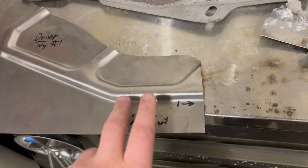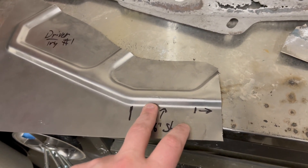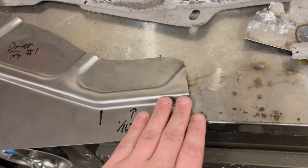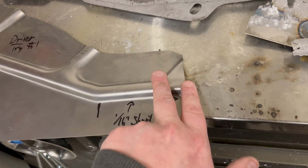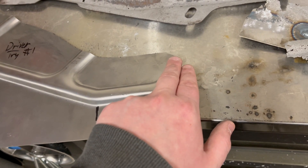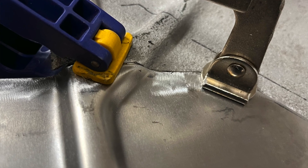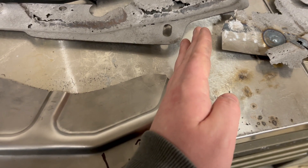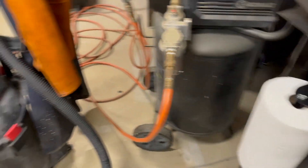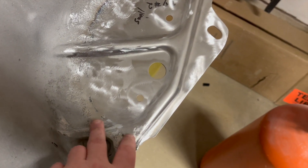The 3D scan software will get me to probably within a millimeter or two of where everything should be — it's not a thousand percent precise, it's literally my iPhone, not some $10,000 3D scanner. So this being just a hair short made it, when I tried to join it in, pop out just a little too far. I ended up with something that kind of looked like this when I welded it in. That's why this piece got so thin when I tried to grind it down. The piece just got paper thin, so I was able to just fill it from the backside and sand it down.